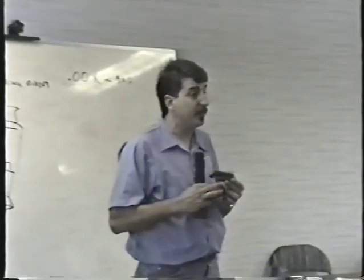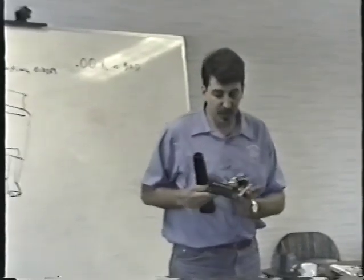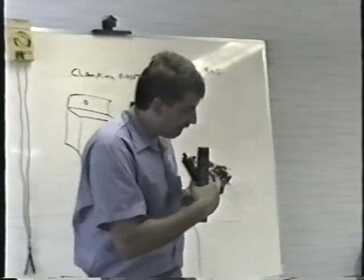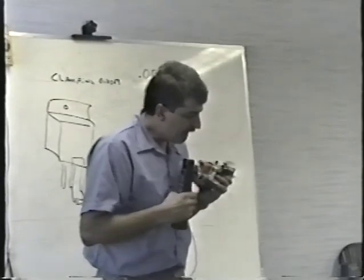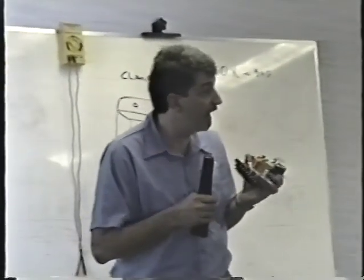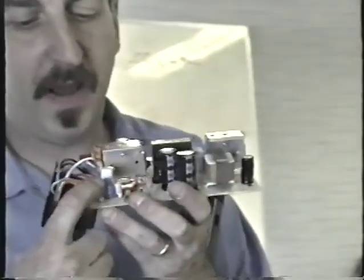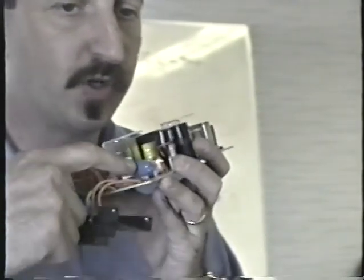So if the fuse is blown, that's basically it. In fact, there's only one other thing that I've ever seen blow the fuse, and that's this blue capacitor. We were talking about the AC line filter earlier, how we have the AC line filter coil, and then one of these capacitors right nearby it. I have occasionally seen this capacitor be the problem. I've seen this blue capacitor right here short circuit a couple of times.